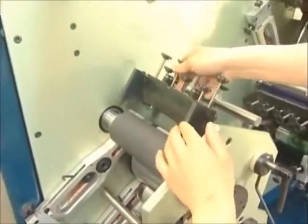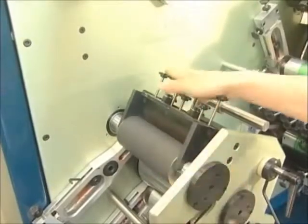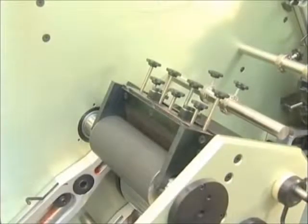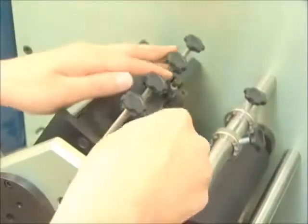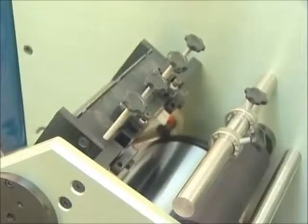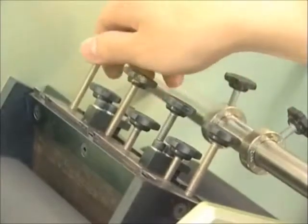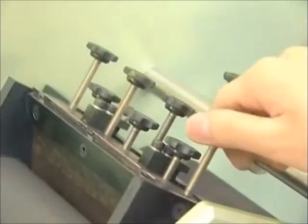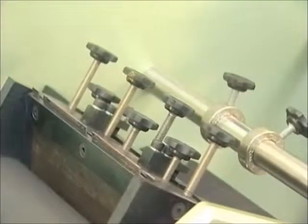equip it on the printing machine. Press the ink fountain hard towards the anilox roller to make sure both sides of the printing unit's backlit plate are completely embedded in the printing machine's ink fountain. The next step is to use the handle to tighten the 2 big circle screws of the ink fountain. Ensure the ink fountain is stable enough. Thirdly, tighten the 4 long screws and 3 short screws gently. Attention, they cannot be too tight, otherwise the blade will easily be damaged.